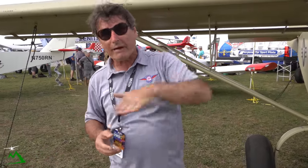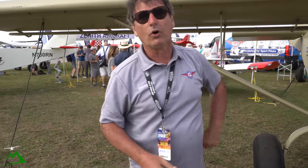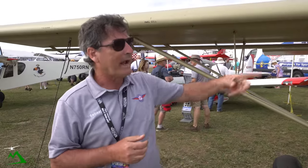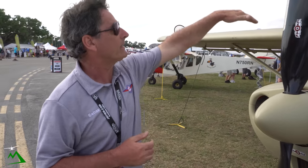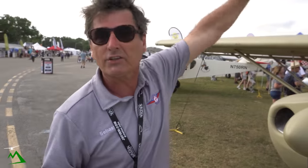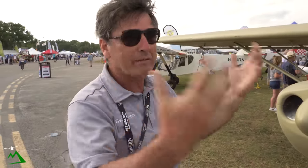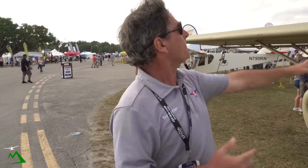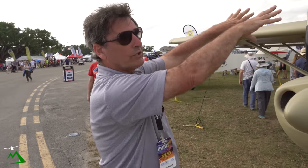In a turn you get all that visibility on top. In a car, a skylight is nice for light but doesn't help you go anywhere. In an airplane when you're turning — especially bush flying — you're actually looking through that top window to see where you're going. So it becomes a really important part of that. Another advantage you'll see here with the prop: you can lift your camera just a little bit and look at the tail — you're actually putting fresh air right on your tail section. So at very low speeds when you're coming in and don't have as much airflow over your tail, that section coming in opens it up to allow fresh air on your rudder and elevator section. This airplane has really maximized its low-speed flight handling characteristics.